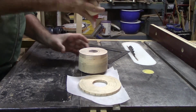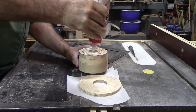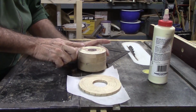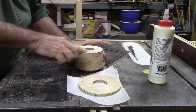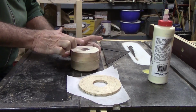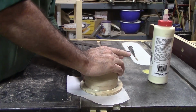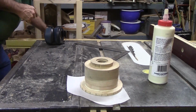I'm using a threaded wood faceplate to which I've already added the first segmented ring from my leftover pile. This ring is cherry with 12 segments. I've also added a piece of solid pine before the segment ring. I used the usual yellow glue for both of these pieces of wood. Now I'm adding a 24 segment ring of oak. I don't remember which projects these came from. Normally I would not randomly mix rings of different numbers of segments, but this is segmented hash after all.